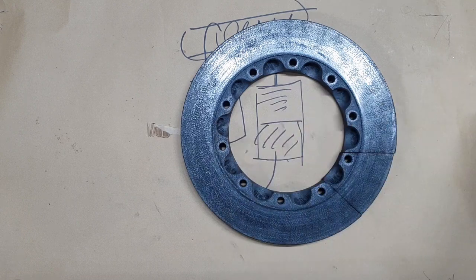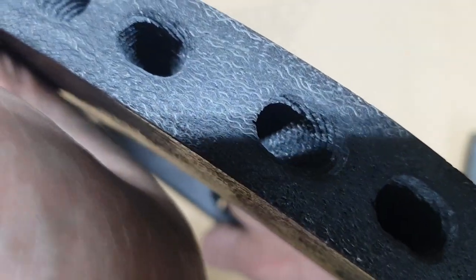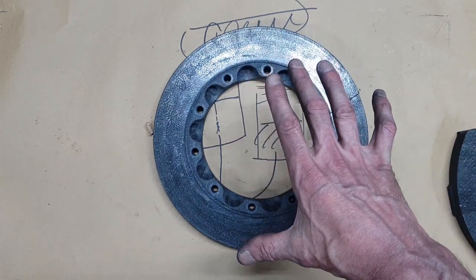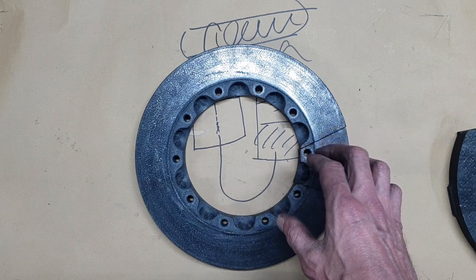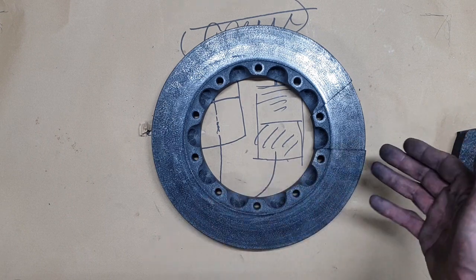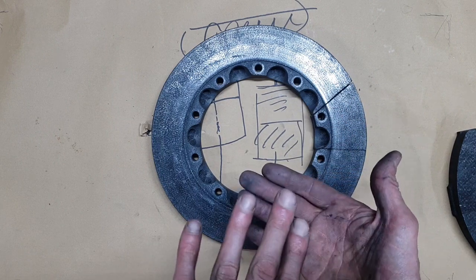The fabric or carbon is stacked in alternating layers — you can actually see the layers here, all those little squiggles are different layers. They're compacted, oxidized again in air at approximately 250 degrees, squeezed, and then carbonized — or graphitized, there are various terms for it. I know all the terms but I've got NDAs signed, so I won't go into full detail. The layers are compacted in a jig under huge pressure and put into a furnace.